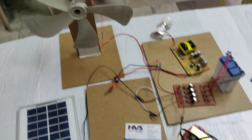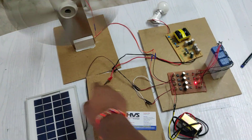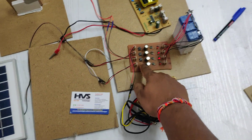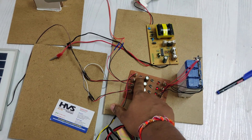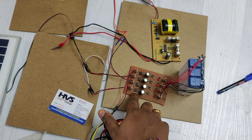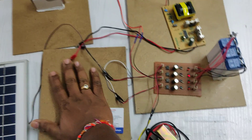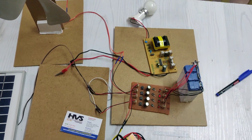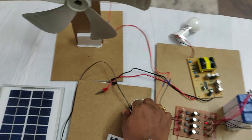Now for the indication — when we rotate the wind turbine, the wind LED turns on. The remaining three sections also have rectifiers. The transformer section acts as a rectifier for AC input. The piezo also provides an AC signal — when force is applied (charging and discharging), AC current is produced. The solar panel provides only DC.